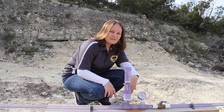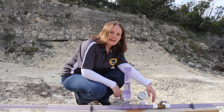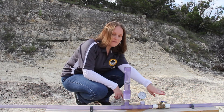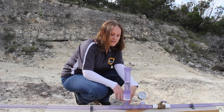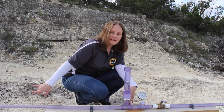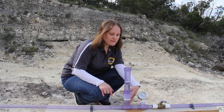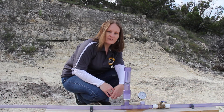That's a pretty neat thing. As the water travels along and comes to a fast-closing valve, it'll come back and the force goes up here, compresses the air instead of going back and shaking the pipes — and that's how a water hammer arrestor works.